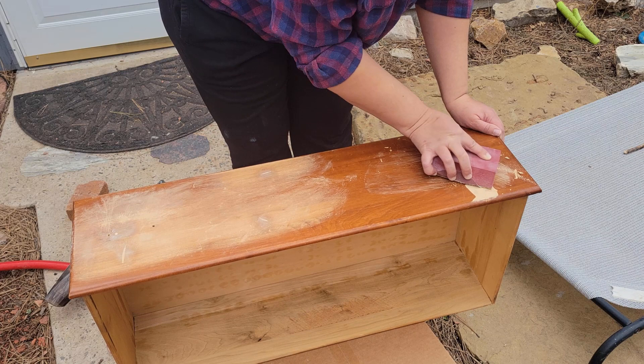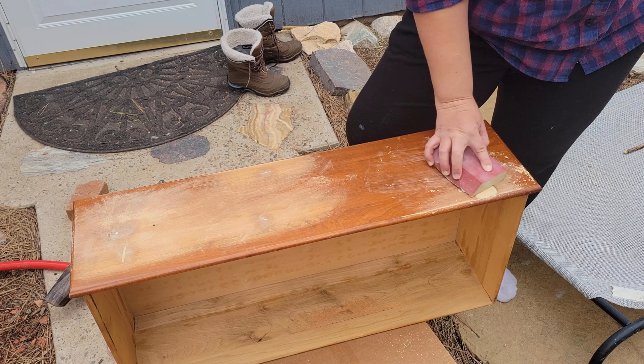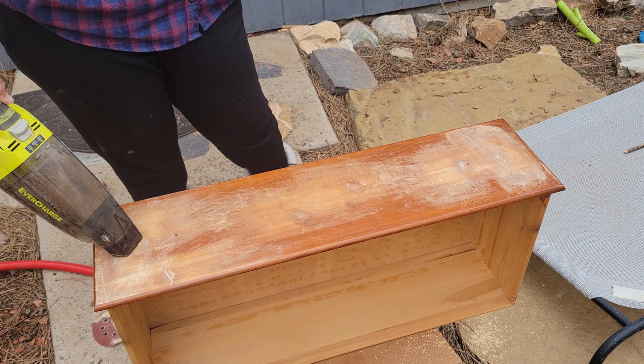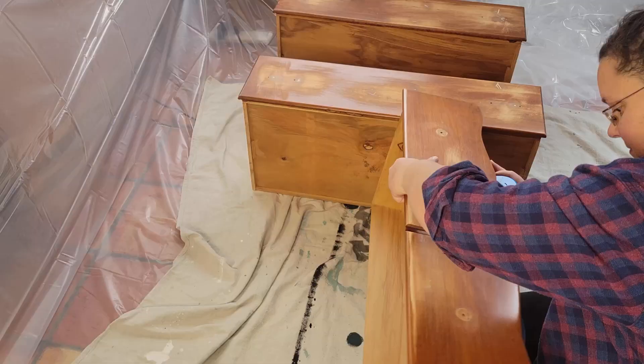You don't want to sand too hard or you'll knock the product right out of the scratch. I was using 100 and 120 grit sandpaper, alternating between the two, and it worked just fine. Even the hardware holes held up really well. This product turned neutral pretty much immediately for me, which is the sign that it's ready to sand. I'd follow the wait time on the container — I think it's 2 to 4 hours — but I waited overnight because the casita was pretty cold that day.